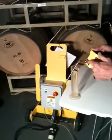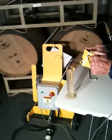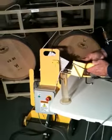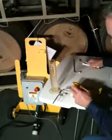Use a 5/8 wrench here on the body and a 9/16 wrench on the nut. Tighten a little bit more. If it didn't pass the leak test, then go back through it again. So we'll try that one more time, but let's do that after we put a new sensor on. I want to demonstrate how simple it is to change the sensor out.